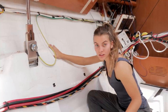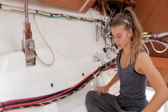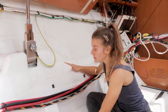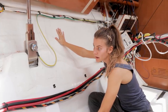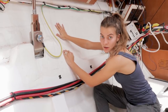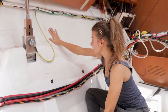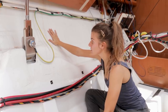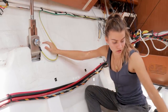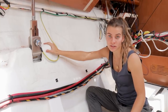In everything I've watched and read about the construction of this boat, I'm going to guess that it wasn't band-aided. What we're seeing is the grid structure, which was made in a mold — popped out of a female mold — and then we've got the hull, which is also made in a mold. The section where the grid meets the hull was fiberglassed together by hand, so that's why this looks so smooth and flawless over here versus the hand-laid fiberglass over there. They don't fiberglass the grid down to the hull — they just use a bonder and glue it down. But I think we should take some pictures and send them to Beneteau just to be sure.